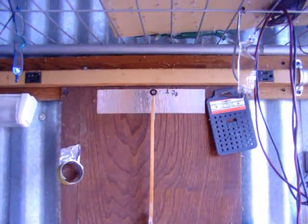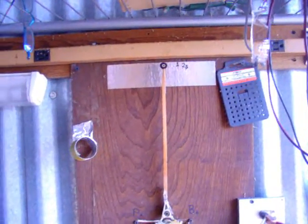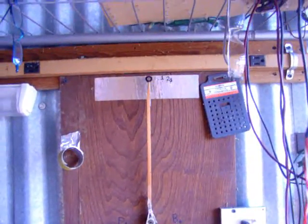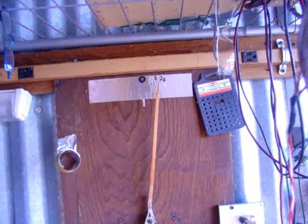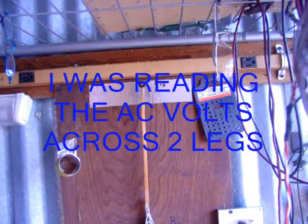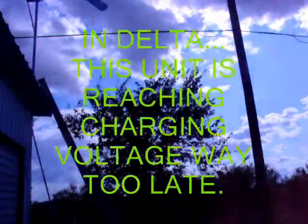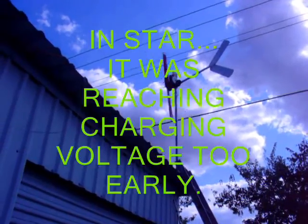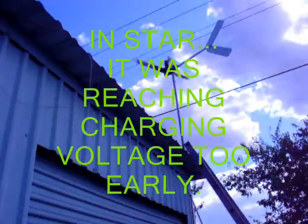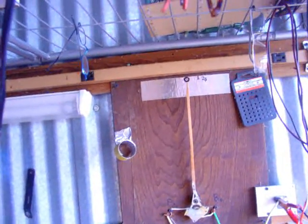The difference between this and the tape drive is kind of surprising — the needle just kind of moves forward quick and then stays. When the wind dies it goes back. I think it's got a better ability of dumping its amps. It's down to about three volts, four volts, going back up — five, six, seven — there's ten, eleven. Didn't quite make it there. There isn't much wind out here. It's barely moving, looked like it just caught a breeze — it's probably around six, seven, eight volts. Right about there is where I want it to hit charging voltage so when there actually is power in the wind it'll start doing something.